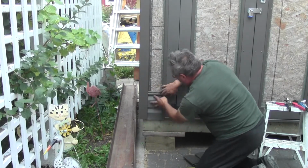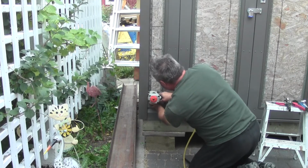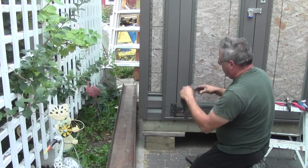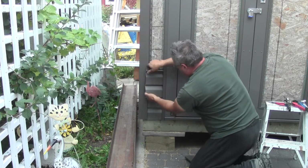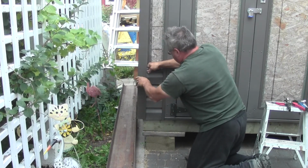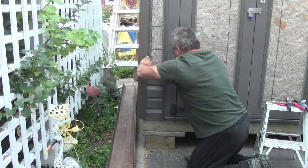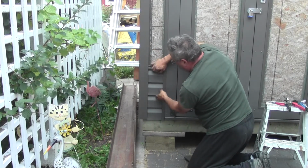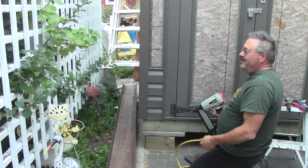And you just hook that on and it clicks into place, and then you just put your siding on. Step your siding in and on to the next piece. Now, normally it's a little easier than this. This is going to be a little tighter because I've got not very much space to play with. Until it just hooks the bottom there, and just keep on going all the way up, and that's pretty much it. Just go until you're done the building.